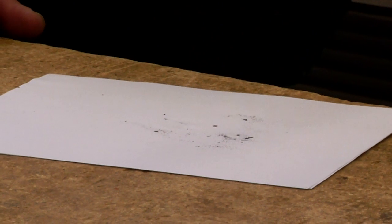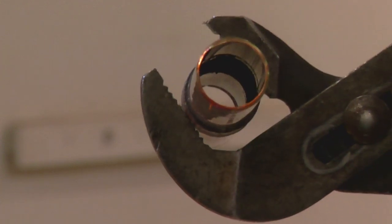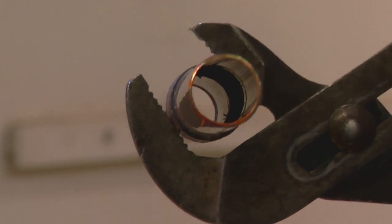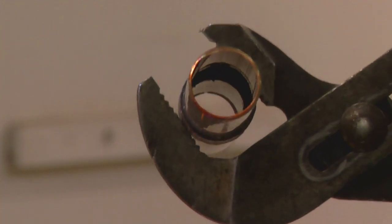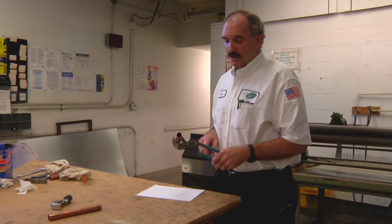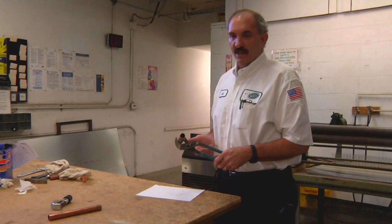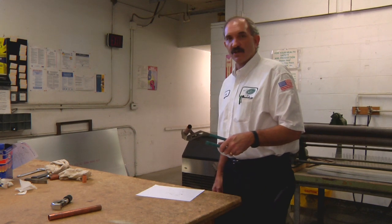That's part of what was on the inside of that pipe left over from the soldering process. We're trying to show a shot of down inside the pipe. Even though I tapped it here, there's still a lot of scale built up on the inside of that pipe. But that would remain in the pipe and get into your system. The POE oil that's used with 410A Freon is a solvent-based oil and it would wash all that out of there, keep moving it through the system, and could potentially clog up your piston orifice or your expansion valve, causing problems with your air conditioning system.